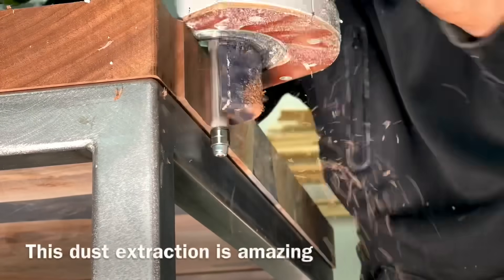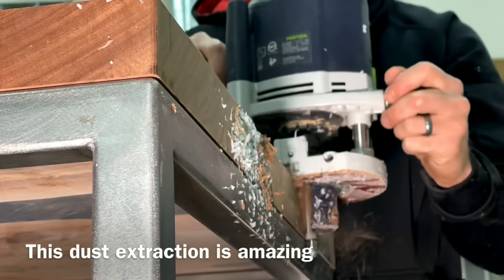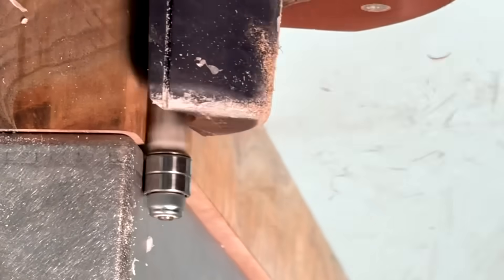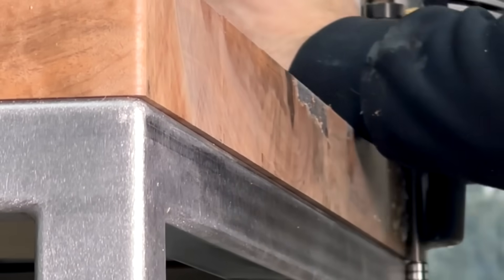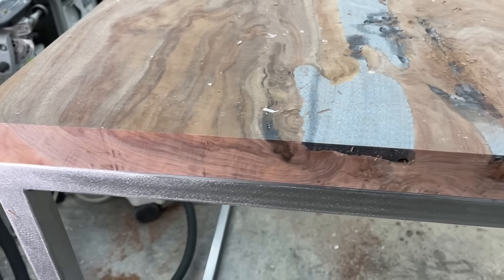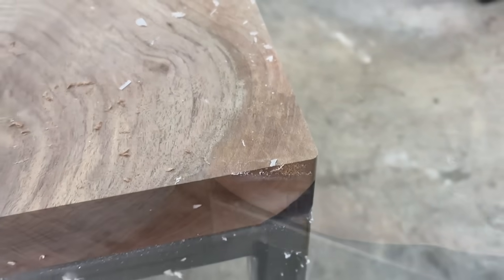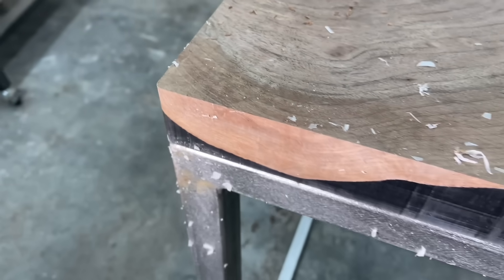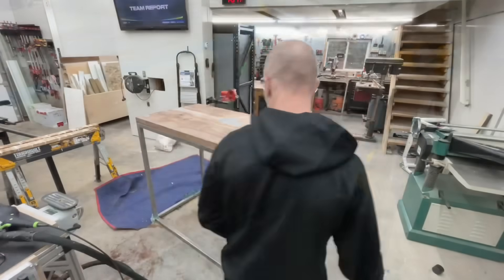Using this flush cut trick is a really cool technique. Some metal fabricators let steel get too hot and warp, but since we're cutting the space to fit it exactly perfect, it can make up for any imperfections in your base. The flush cut trick is no substitute for sanding though — you'll see there are plenty of places where I wiggle the router and I'll have a good bit of sanding to smooth everything out. I'll keep the top on here a little while longer so I can use it as a sanding guide and get that finish perfect without any rounding.